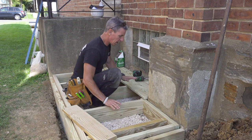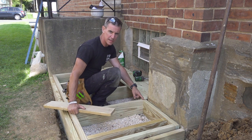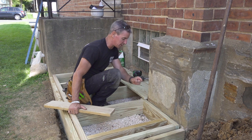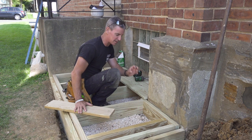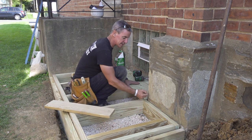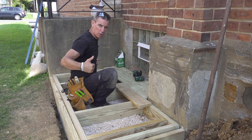A little brain tickler: the five-quarter by six southern yellow pine pressure treated decking is five and a half inches wide, and five and a half inches brings us out just past the chimney. My first thought was to cut a notch, but the chimney angles, so it turns into a full piece and a really long sliver — and sliver cuts are an inelegant solution. Instead, we'll take a full piece, cut it down to the width of our chimney reveal, rip it on the table saw, route an edge on it, and then run a full piece right along the chimney, working our way out with full deck boards.